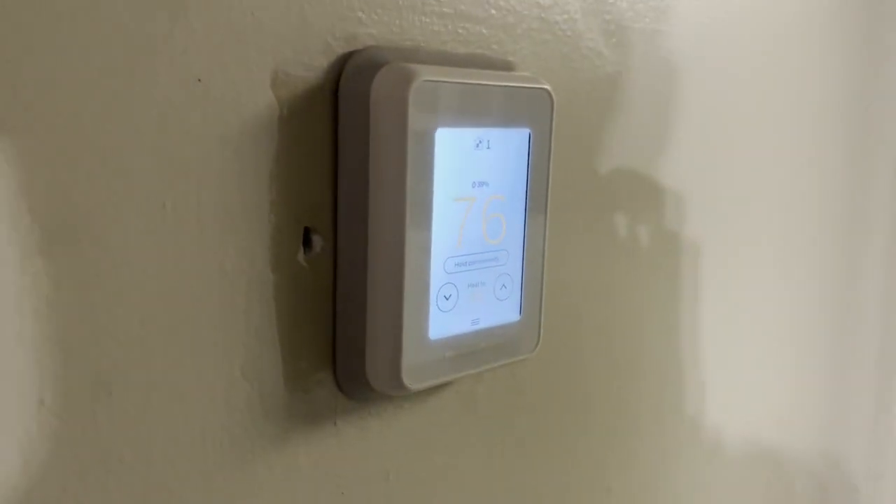That's how we heat our house — both with the wood stove and the boiler with the new thermostat. It'll keep the rooms nice and even. You do not need a C-wire adapter or anything like that if you've got a boiler system with zone valves — you can certainly hook up a smart thermostat no problem. If you have any questions, drop a comment below. Like the video if it helped, and subscribe to the channel to learn more about living in the country. Until next time — from our homestead to yours, M&M out.